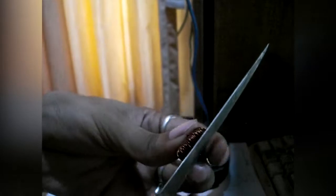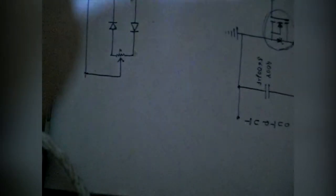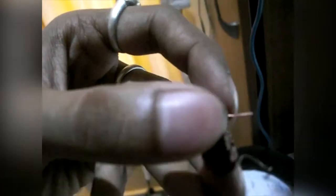Make sure you do not cut your finger — carefully scrape. See, it's done. You can see how it shines. If you remove the enamel coating you can see the normal copper wire, which will shine like copper.